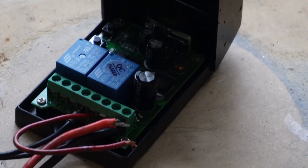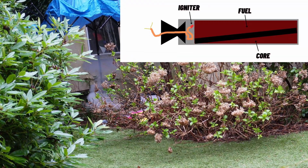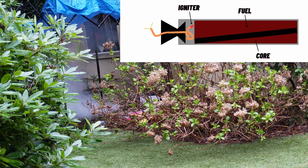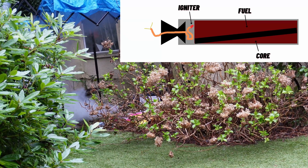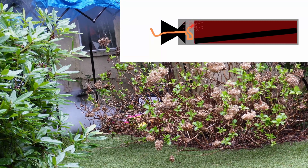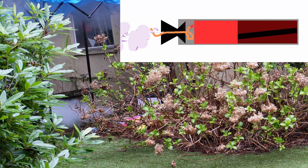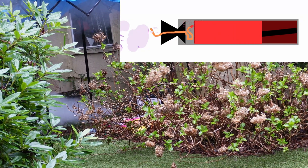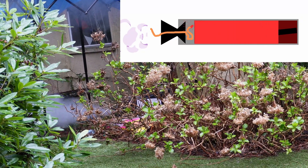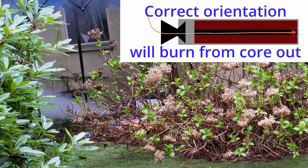These wires are coming down — everything's going to be tight in there. I was being a dumbass here: the fuel grain was loaded incorrectly, so the cored end was on the side of the nozzle. This meant that when I inserted the igniter, it was just getting scrunched up in the convergent section of the nozzle. So when it was lit, it was just an end burner — it never reached operating pressure. At this point it was just a big smoke machine. At the very end you get a little bit of pressure buildup, but I should have been more patient and switched things around.